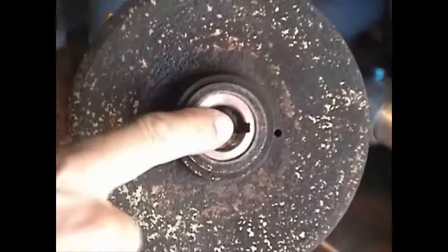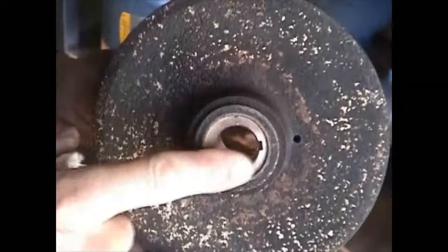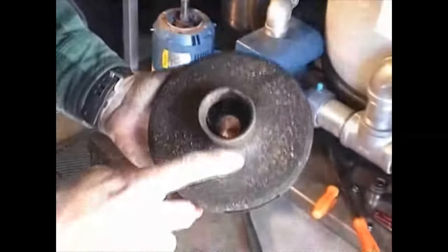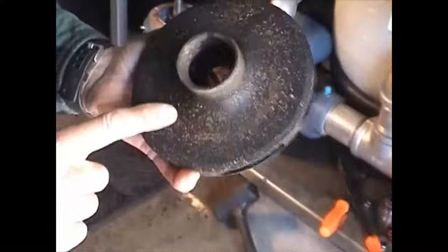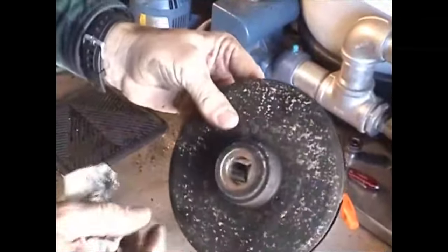Once it's clean, inspect your parts. Inspect the shaft key for straightness and make sure the edges are sharp. Make sure there's no pitting on your impeller — if it looks like Swiss cheese, there's been cavitation and the impeller is no good. Inspect both sides and all wear surfaces. Check the impeller vanes and make sure they're nice and sharp and not worn out. If everything looks good, you can reuse the same impeller; most of the time those impellers will last for years and years.